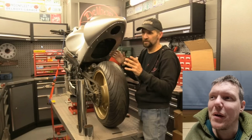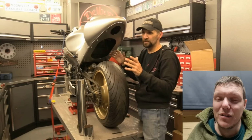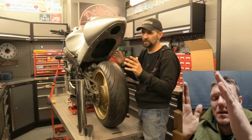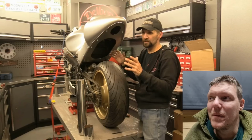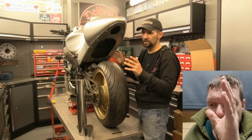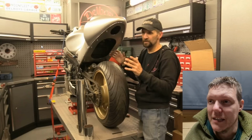But the problem is he's bent the subframe. And by the look of it, one side has come in more than the other. And it's probably twisted. But you look at them turrets that stick out the top, the whole thing's twisted. And when things twist, they pull in. How much is pulled in and how twisted it is? But if all these mounting points were off the original subframe that he hadn't molested, then fine, I could believe that that's straight and square, but I don't.